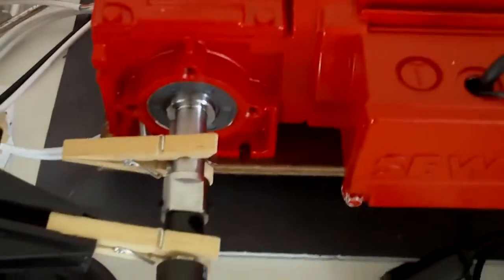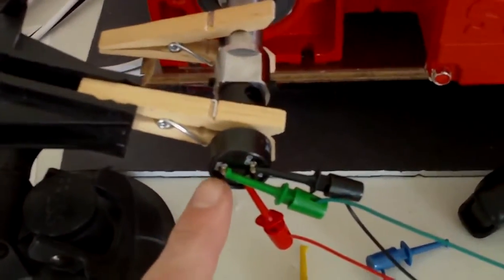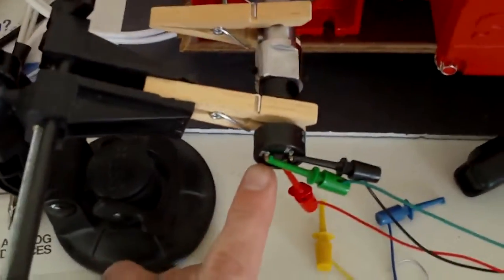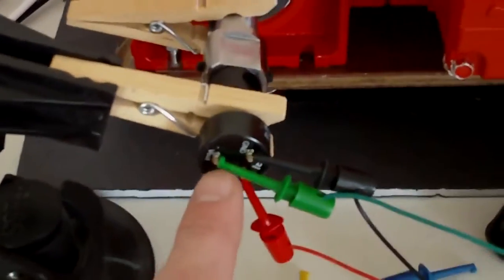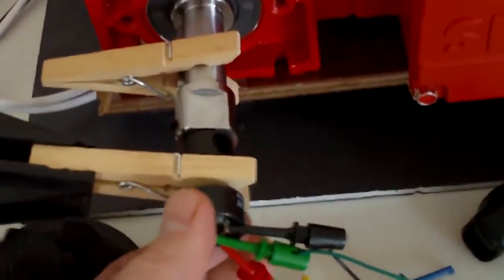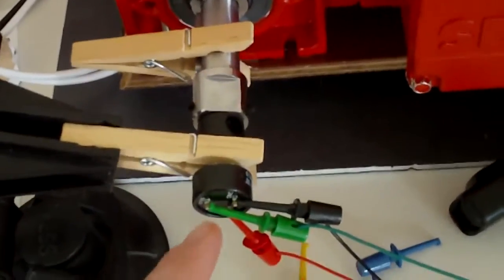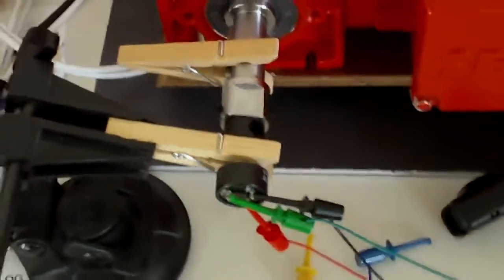For the motor to know the position it has to stay, you need to connect on the output, align to the output sensor, position sensor. This one is by Technologies, I don't know if you can see it here, a 180-degree sensor. That's digital, that means that it's not like potentiometers. It's actually magnetic Hall effect, so it can measure exactly 180 degrees from fully up and fully down.